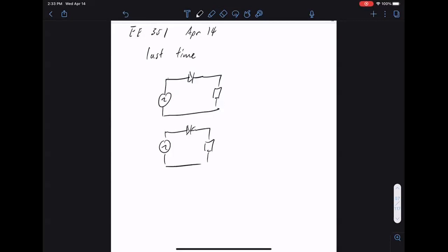But the fundamental difficulty with this kind of approach is you lose half the wave. If you look at the load voltage, you get half a wave, then nothing happens. So this may not be very efficient, right? Half of the energy or half the power doesn't come through the rectifier circuit. So we'll start this class by covering something called the full wave rectifier, and then we'll go to DC-DC converters.